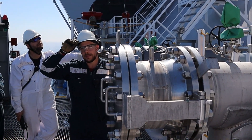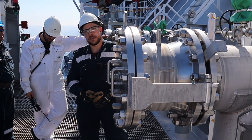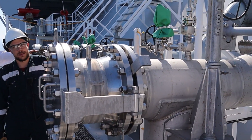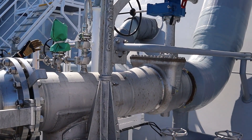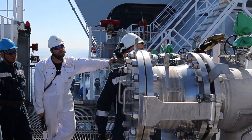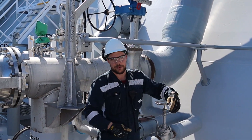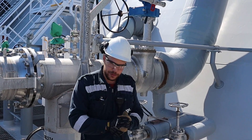This is basically the completion stage. We've completed the discharging or loading operation, and now we're explaining the draining procedure — how to drain the manifolds. We close the double-shut valve, then open the ESD valve. Shore will supply nitrogen, and when the pressure reaches around five bar, we line up to drain via the spray line and the cool-down valve, sending liquid back to the cargo tank.